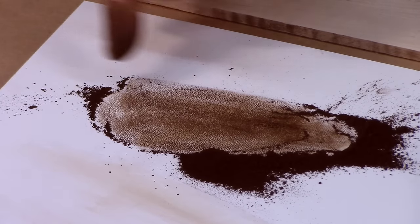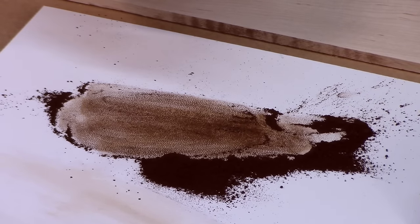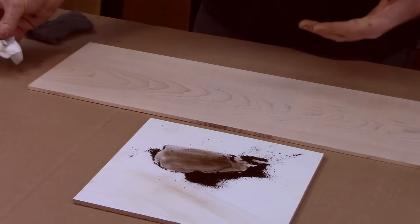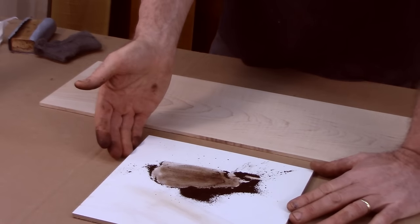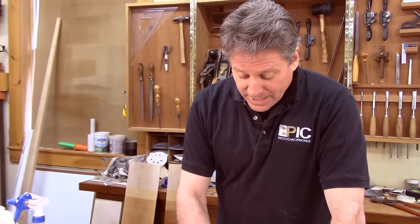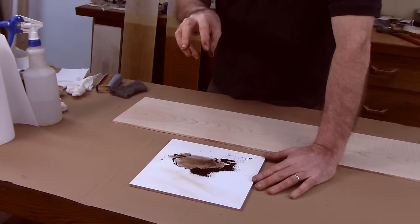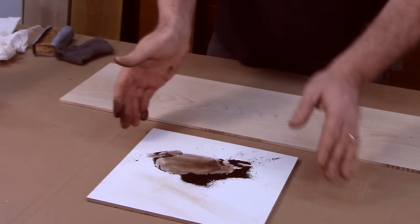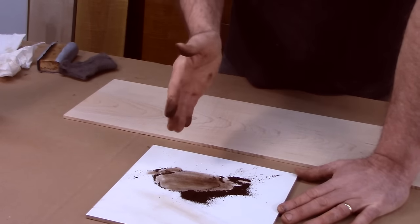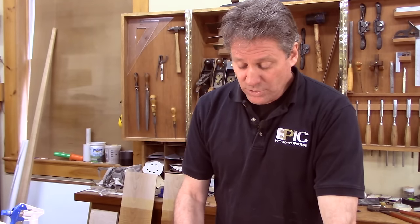Pigments are very prominent in paints as well. The thing to keep in mind is that a pigment is laying a color on top of the wood — it's a little opaque. Although you see through it, it does kind of cover and obscure the full beauty and figure of the wood. So you've got to use these in the right way. I almost never put a pigmented stain directly on the wood. I will first dye or seal the wood, and then maybe use some pigment for effects, which I'll be showing you in a little while.